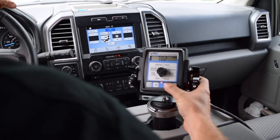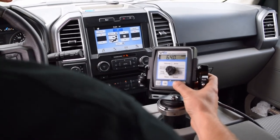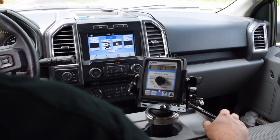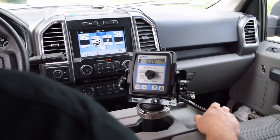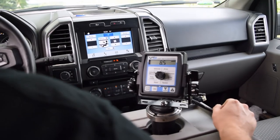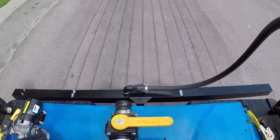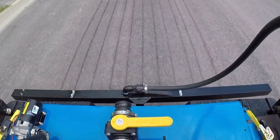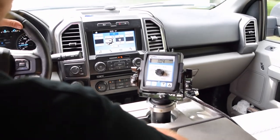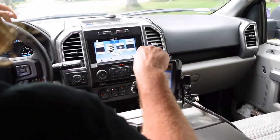Another cool thing is we can switch our rate on the fly. Let's say we're in an area that doesn't have as much snowpack — we can change our rate at any point just by using the up and down arrows on the controller. Now we're putting down 60 gallons per acre: a little lower flow rate and a bit more speed since the pump can keep up. You can also see that the valves turn on instantaneously — as soon as I hit the switch they're spraying, and the controller already knows our speed so it automatically adjusts the flow rate right when the boom section turns on.